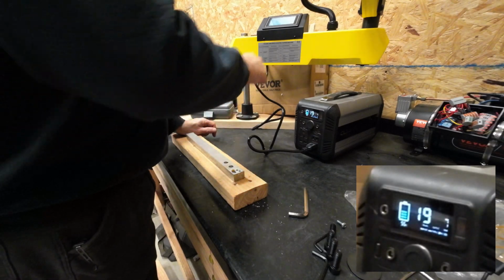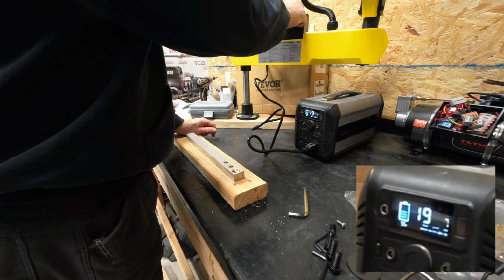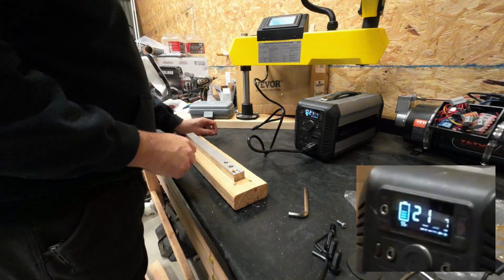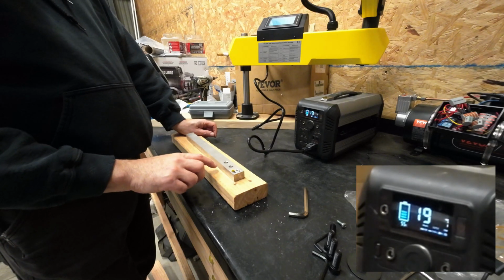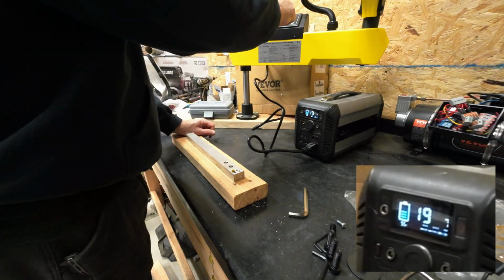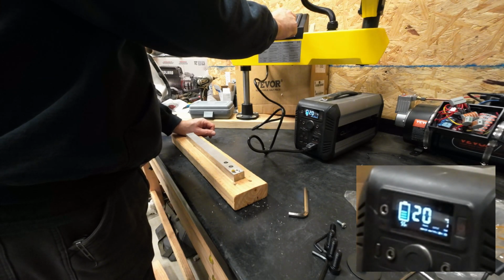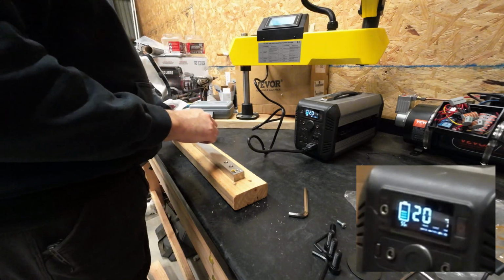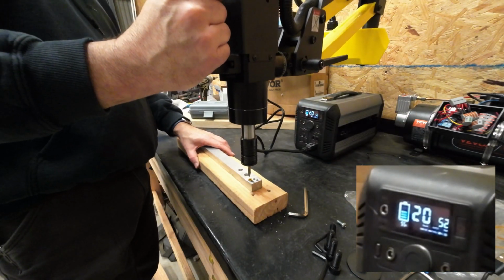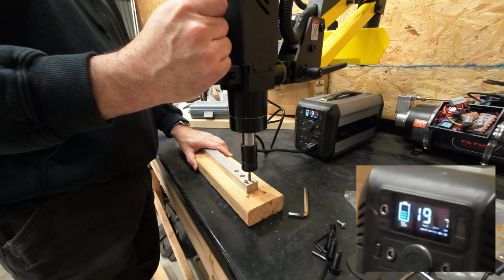Automatic, M6/1, feed speed 100. We're gonna go a depth. It's set at 25 millimeters an inch, huh? So we're gonna go, this thing is 19 millimeters thick, 3/4 inch. So let's just take it down 12 and back out. In real life. All right, give it a go.